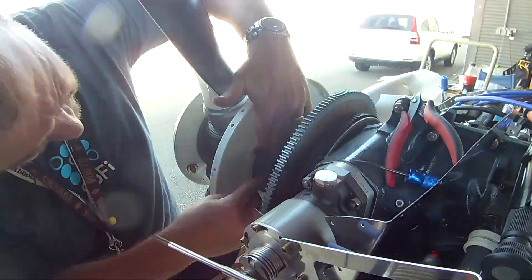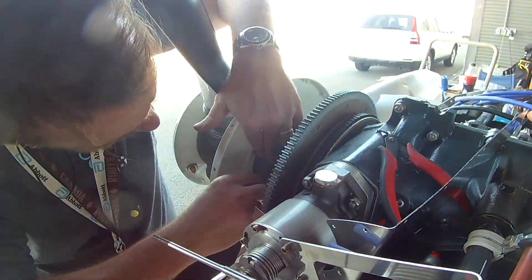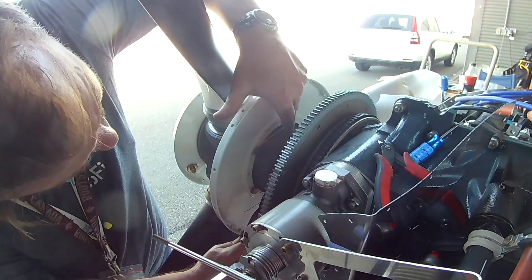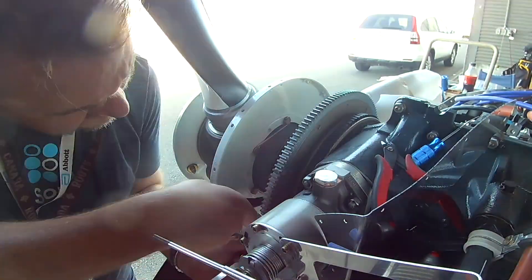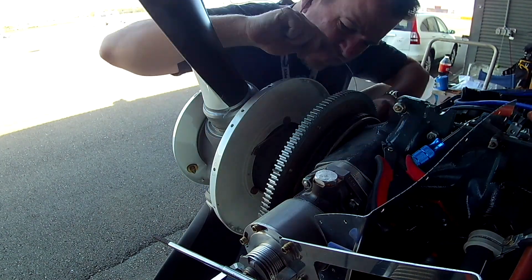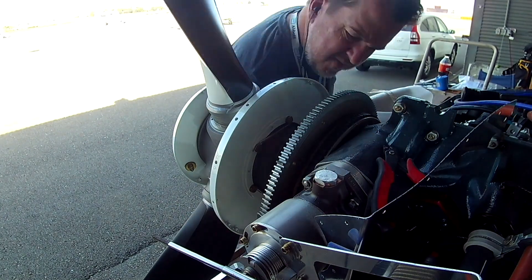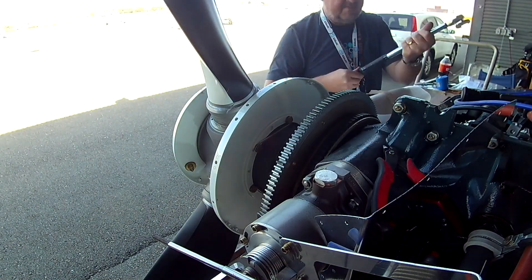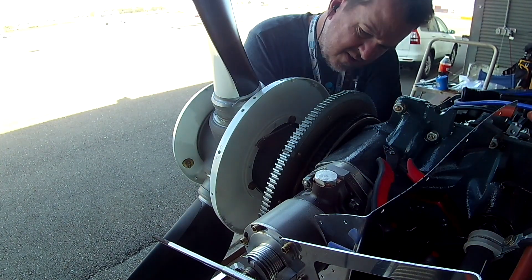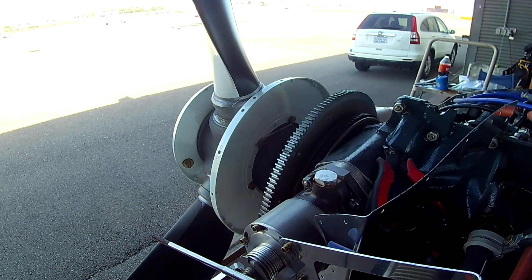So when those prop bolts — the prop bolts have a channel in the middle to be able to slip safety wire through. When you're torquing these things, I found that three of these bolts, when they were torqued right to 42 pounds, were perfectly perpendicular to the prop itself. So as you try to put safety wire through, it would just hit the bottom underneath and it wouldn't actually go — because you need it to sort of slip to one side or the other and push it through so you can grab it and pull the safety wire through and then safety wire it. No such luck.